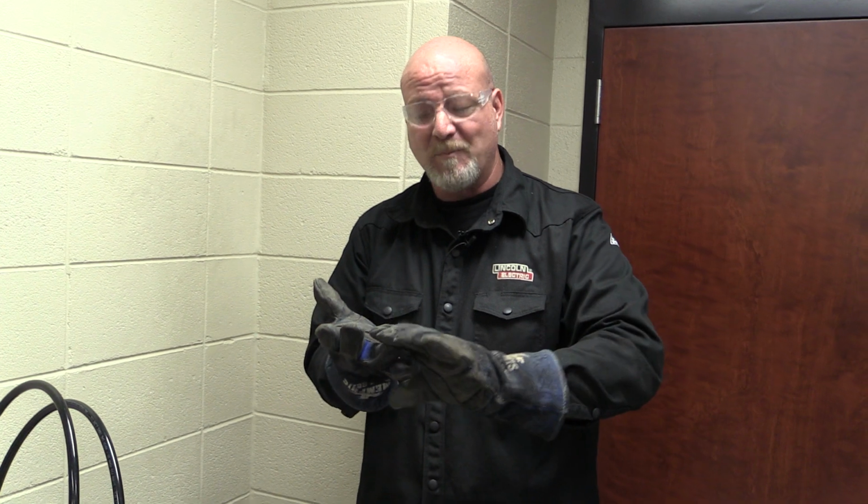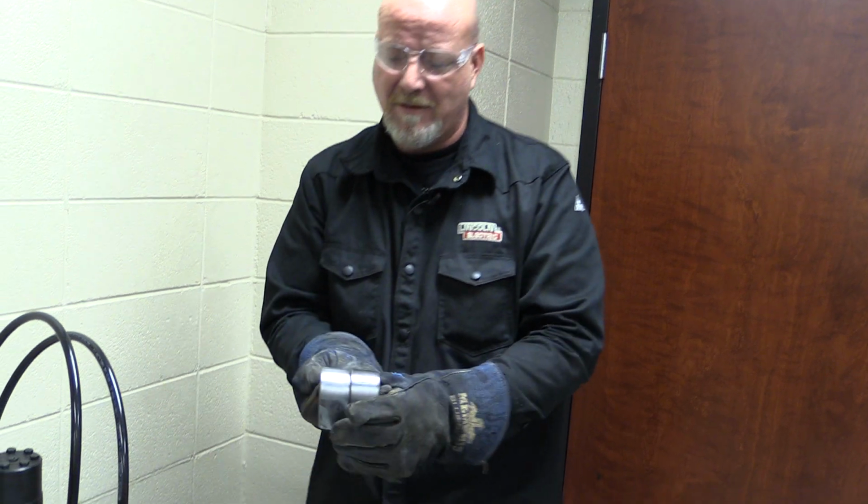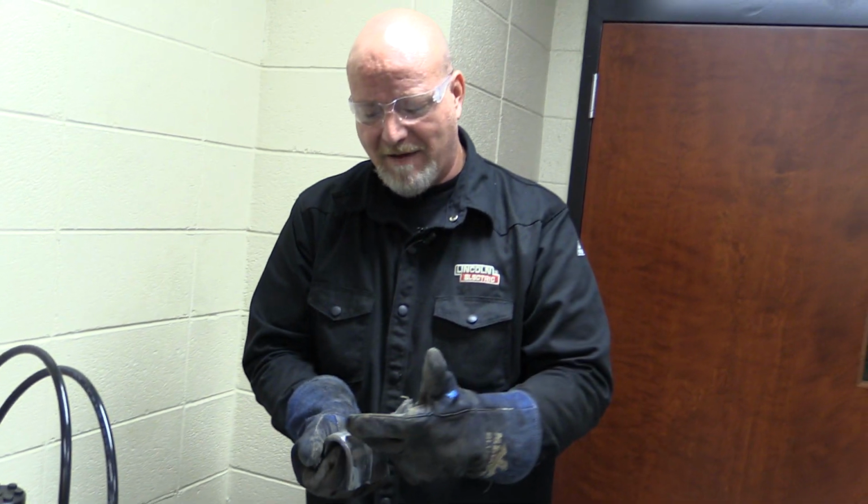So when you're doing these V-groove butt with backings, remember, correct bevels, the procedure will tell you that. Remove the mill scale. Tack them up tight. Craftsmanship is important. Make them nice and even. Remove the backing strip and the weld, not too far, because we're going to use the belt sander to finish them off. Cut your pieces, 3 pieces at 1.5 inches. Take them to the belt sander, touch them up a little bit, bring them in here, and they will either pass, they will have some discontinuities, or they will snap in half like an overcooked sugar cookie on Christmas morning. And then you go do another one.